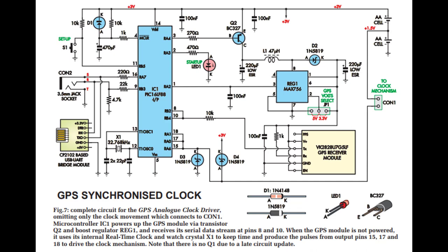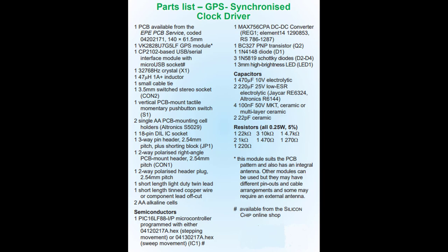This module is based on the U-Blox Neo7 chip and has slightly better sensitivity than the previously used EM-408, with a specified tracking sensitivity of -162 dBm compared to -159 dBm. It also has a slightly lower current drain, at around 30 mA compared to 44 mA, plus a faster cold start average time of 26 seconds compared to 42 seconds, meaning it doesn't need to be powered up for as long to get the time. We have also substantially increased the power efficiency of the GPS module supply, ditched the old-fashioned DB9/DE9 serial cable, and fitted a micro-USB port so that you can easily hook it up to your computer to set up the DST rules and make other setting tweaks.